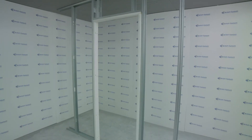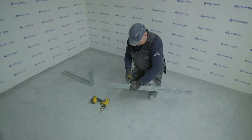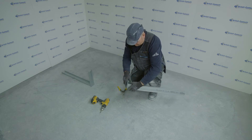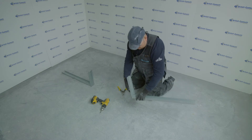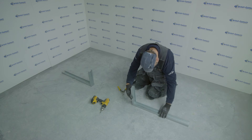Now moving on to the heavy and severe duty door opening. When fixing the floor channels in place, we allow the channel to be 300mm longer at the door opening. This is then snipped and bent up into position for the correct width of the door opening.